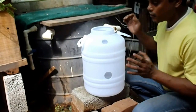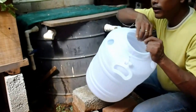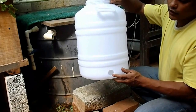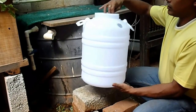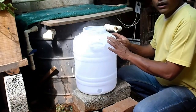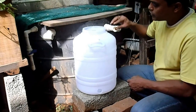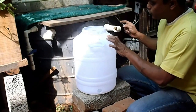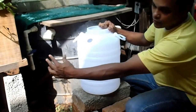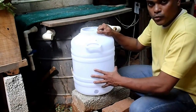Now we have all the holes drilled out. You can see one hole here and the other one here, one here and another one here. So this is how it's going to be positioned. I have a 34mm pipe, so I have a 34mm hole here. 34mm is the input and 45mm is going to be the output, which will be bigger. And this is the 19mm for the drain, to remove all the solid waste.